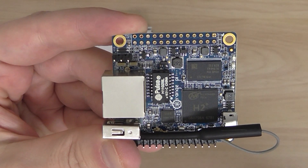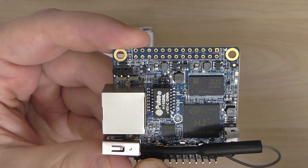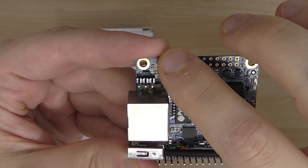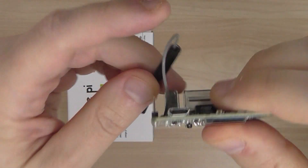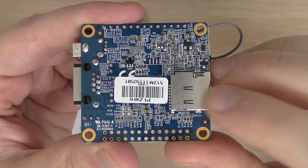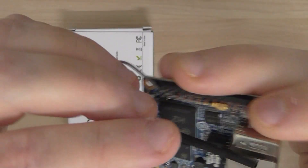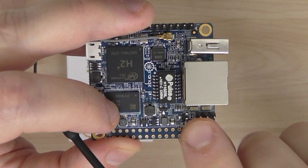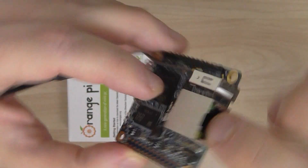This is the H2 Plus processor and this is the memory chip. There are basically two versions: one with 512 megabytes of RAM and a second with 256 megabytes of RAM. You have a 13-pin function interface and also an option for a 26-pin expansion port. On the side you can see the OTG interface for power, and on the back is the micro SD card slot used for loading the operating system, since the board doesn't have an eMMC chip. There's also a debug serial port with 3 pins.